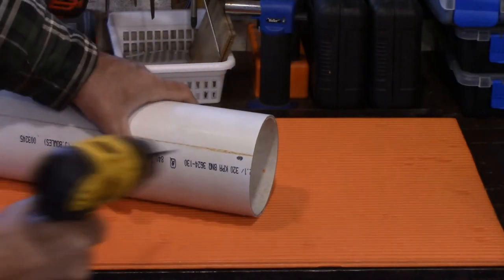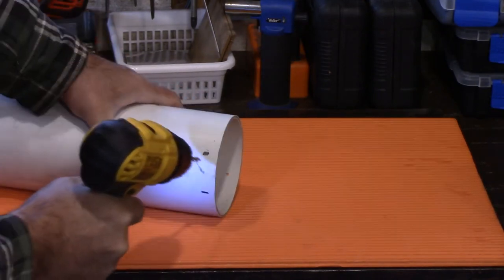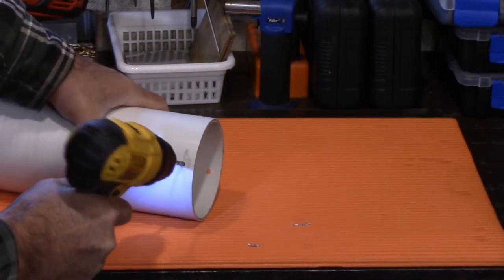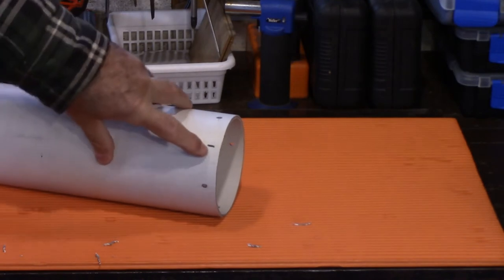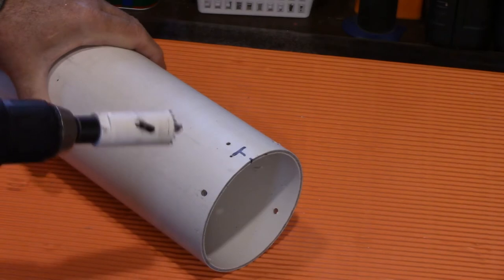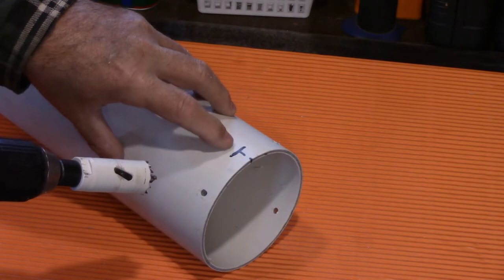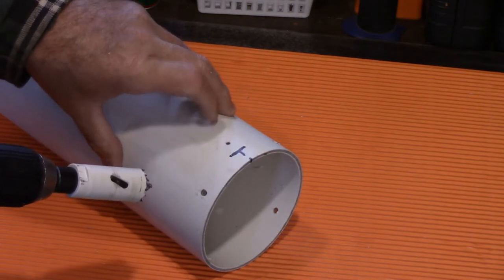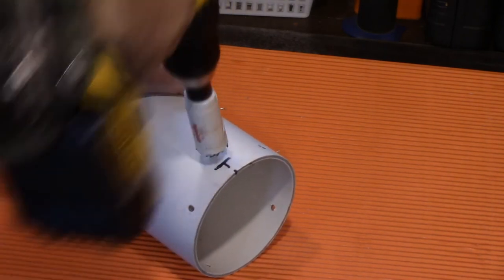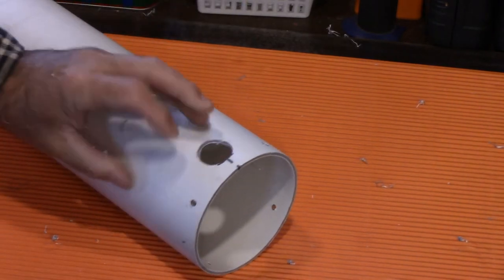I just put a little bit of a pilot hole there first and then put the 3/16 drill bit through them — that didn't take long. So this is the spot we're going to put the hole. We've got a 1-inch hole saw bit and I want the hole a half an inch from the bottom. Let's just punch out that hole first and I'll show you the reason why we wanted it a half an inch from the bottom.